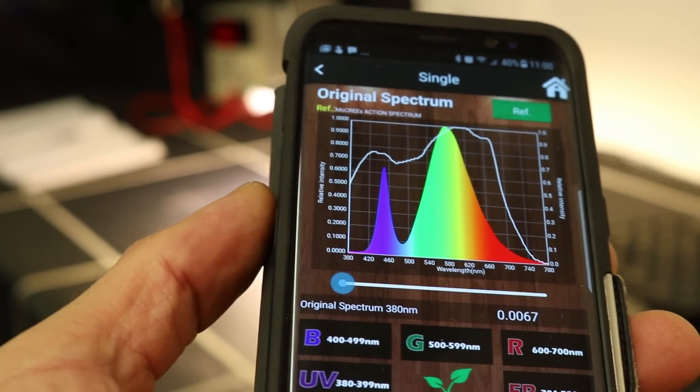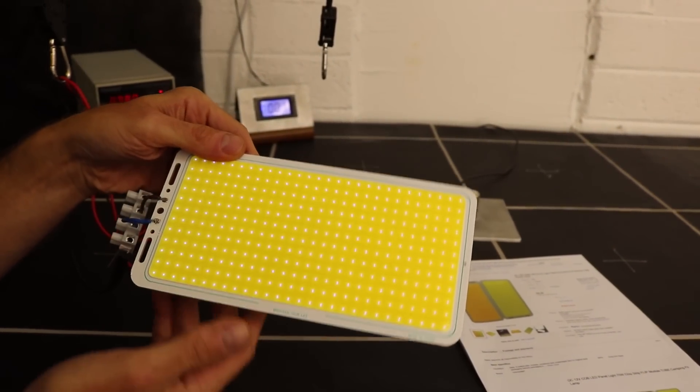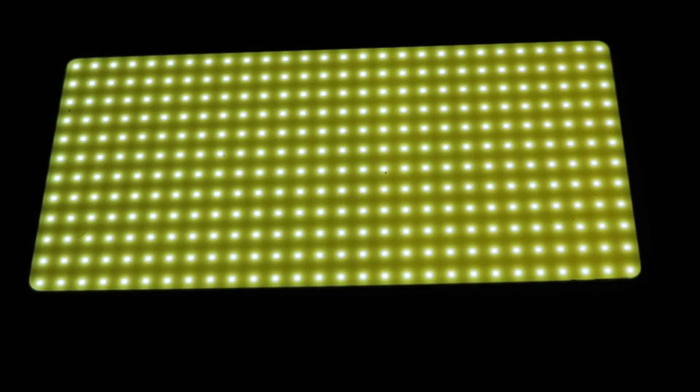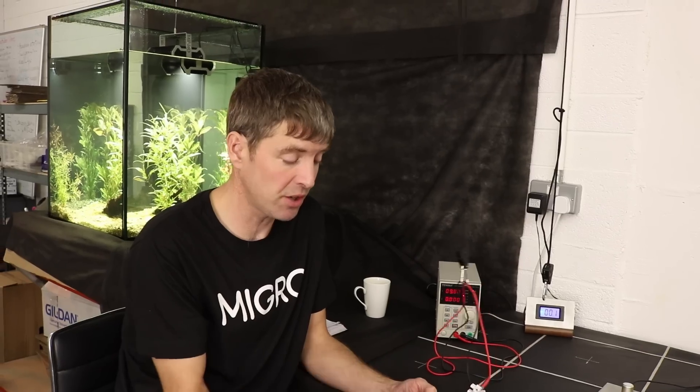If I switch it on here, just at low current, you can see all the little LEDs lighting. This is a really good test — I put this down in the dark and ran it at very, very low voltage and current, less than milliamps, fractions of milliamps. All of the LEDs pretty much illuminated with the same brightness, which shows they're all pretty much the same resistance or values. Because they're very well balanced, the circuit is unlikely to get overly hot and no particular LED is likely to get overly hot.